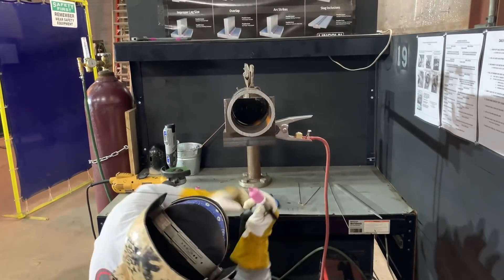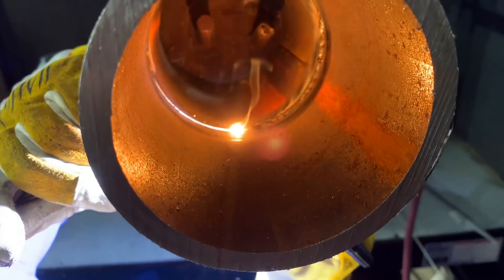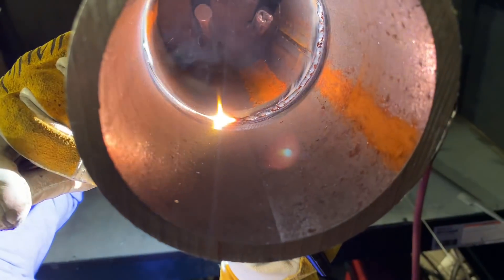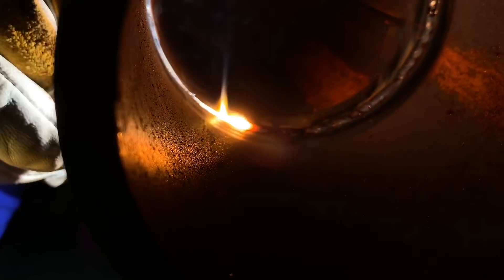Another thing I like about those tips is when you do have to change them out, you don't have to worry about losing the backing cap, the collet, the gas lens, the cup, or any of that. It just saves a lot of the wear and tear on the regular consumables on the inside of that torch head. All the angles are perfect — a 75-degree angle if you want real deep penetration, or a 10-degree angle for a slicked-out cap. You don't have to worry about grinding it this way or that way, arc wander, anything breaking off the tip, or getting left behind or splintering. Everything's just perfectly set, and we've had real good results from these things.